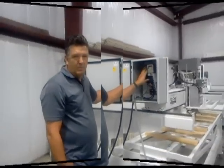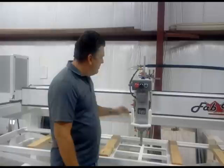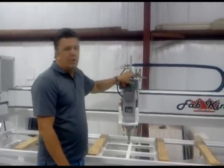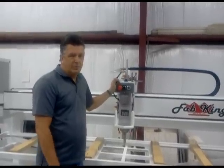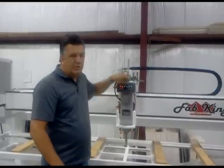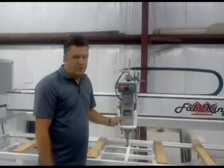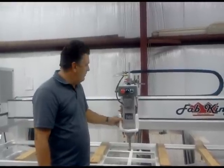Okay. I would like to talk to you about the operation of the machine. Very simple. Stop, start, and speed control. There are no digital readouts of speed or control. The only time you turn the machine fully clockwise to 10,000 RPMs is to cut a sink. No other time should you increase the speed to that.